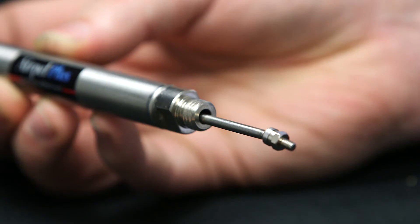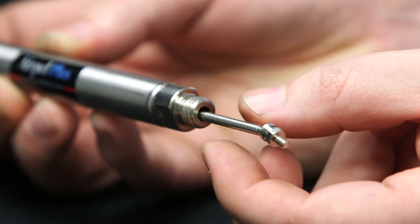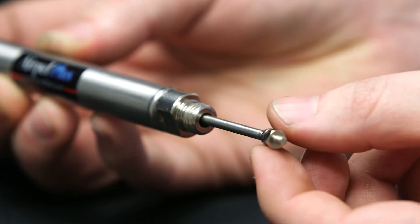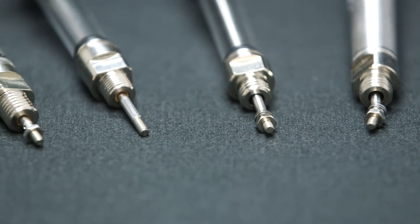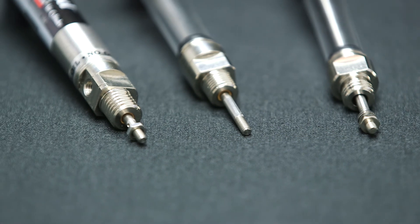It also has no rod guide at the front end so that the rod has a greater range of motion to further accommodate mounting misalignments. As you can see here, we offer a ball joint at the rod end for easy misalignment handling. We also offer straight threaded rod ends if you want to provide your own ball joint. Lastly, all AirPel Plus models are metric only.